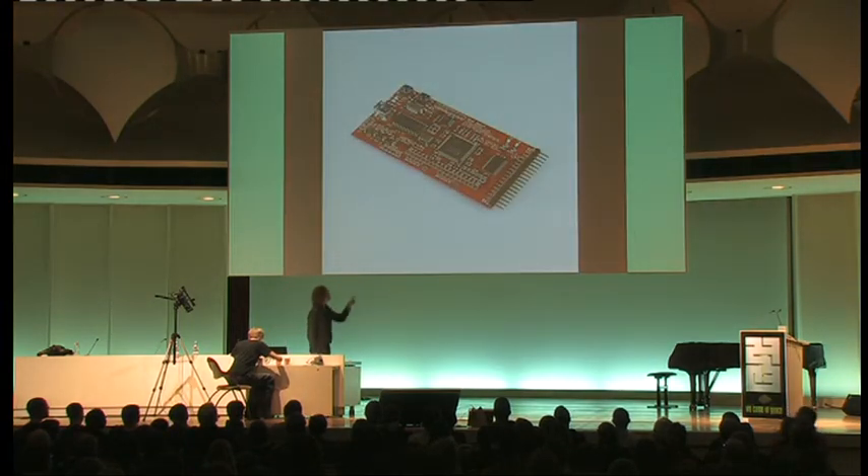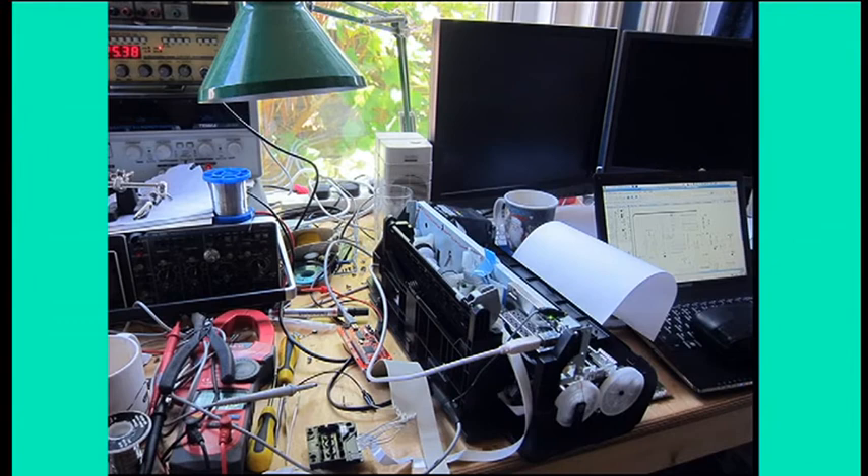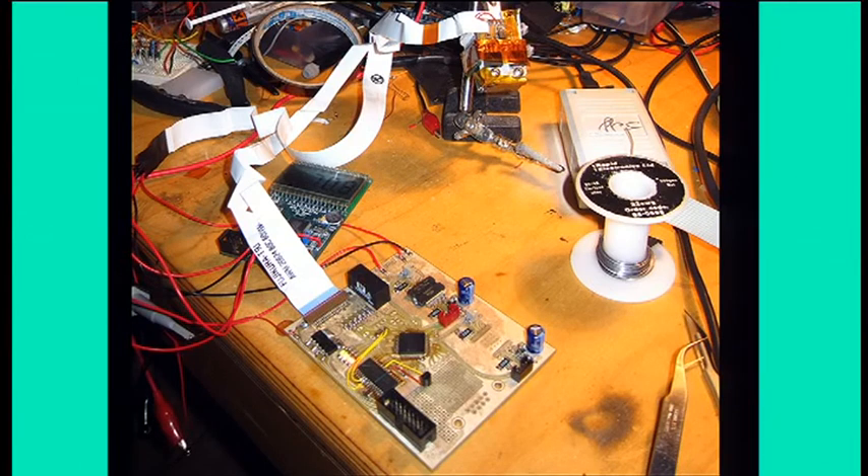I used the Open Bench Logic Sniffer — about 40 euros — and interposed it between the printer's Epson motherboard and the printhead itself, watching the data going between them. There was decent information in the patent about the structure of the data, but I had no idea which physical pins corresponded to which signal. By attaching the logic analyzer, looking at the shape of the traces, and reading the patent, I was able to work that out. Then I built my own board — outsourced, because there's a bit of a chicken-and-egg problem — containing the digital-to-analog converter for producing that magic trapezium-shaped voltage waveform, and the digital bus connecting to the printhead.